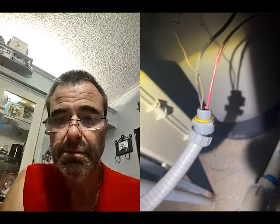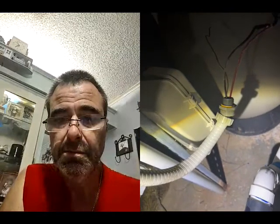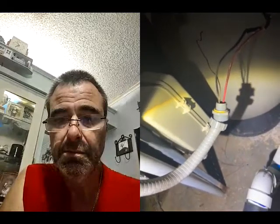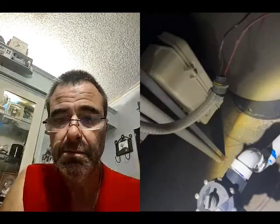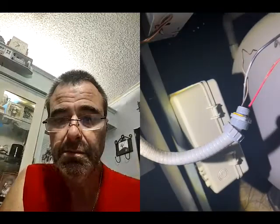Now inside my timer box, there's those wire nuts I noticed, probably because the wires weren't long enough. What I'm thinking, I don't know if this is true or not, is that for this Hayward white box to get power, they might have connected a separate wire going from the white panel box into the timer box. I'm not sure, because I'd have to see the schematic on that Hayward box. Does that get powered with 240 as well?